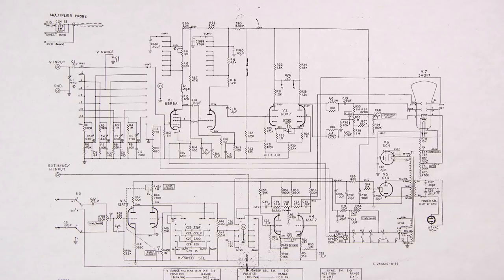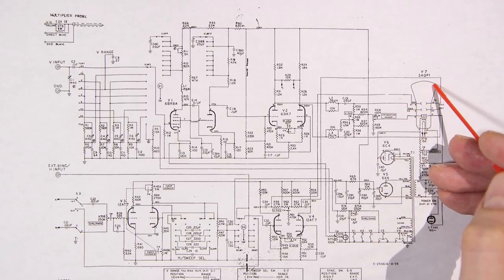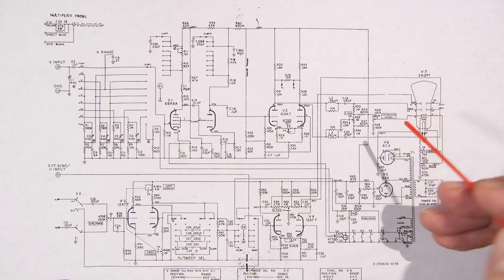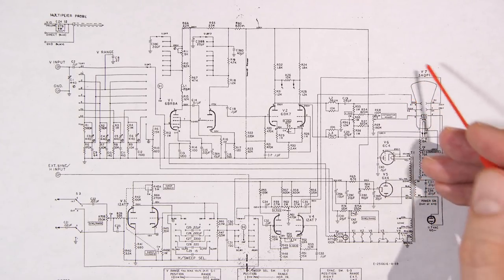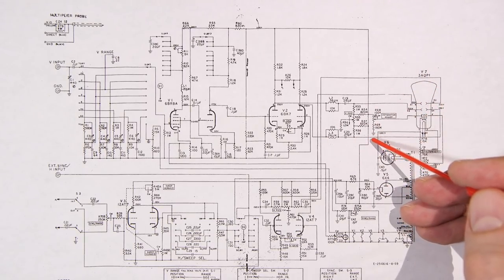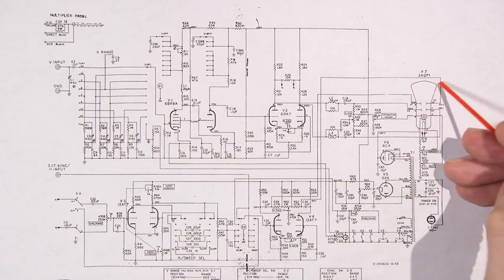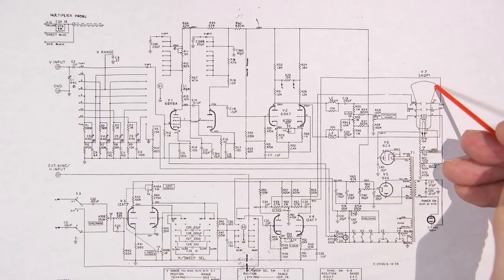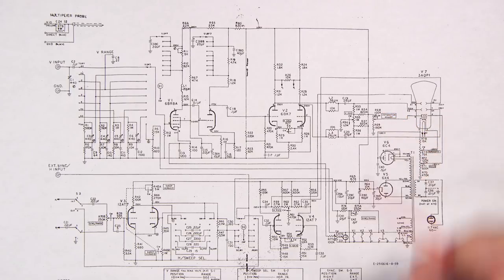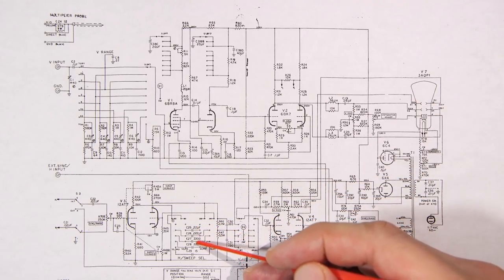If you had something like a P7 phosphor or something like that, as the dot's chasing across the screen, you're going to see a streamer behind it because the phosphor holds light a little longer, just a different type of phosphor. Again, I'll get into this here in the future. We'll stick to keeping this simple today, as simple as I can at any rate. So as that dot's getting driven across the screen really, really fast, it looks like a line. So you can see how this thing is going to draw a graph on the screen, and the earliest oscilloscopes were called oscillographs.